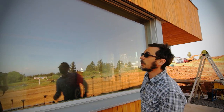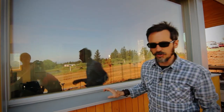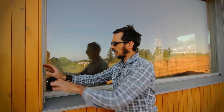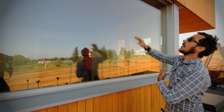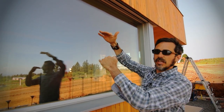With that information in hand, we go ahead and order the things. They come in, and we've already had a local manufacturer make these beautiful little steel surrounds. It's 24-gauge sheet metal that we've painted on site, and we had all these features built into it. This was in the architectural design — we just did some shop drawings and had them build everything. It's essentially handmade. We adjusted the height of the housing so that when the shade is fully retracted, it just fits in there nice and neat.